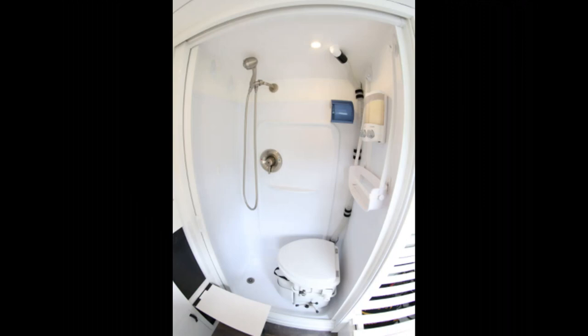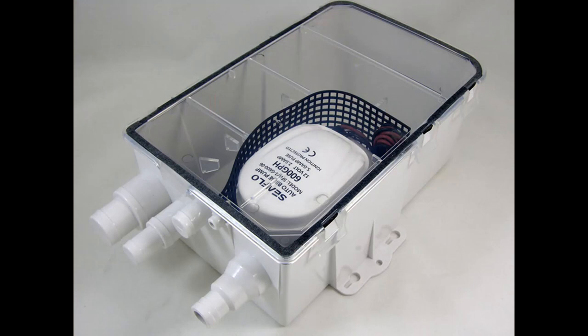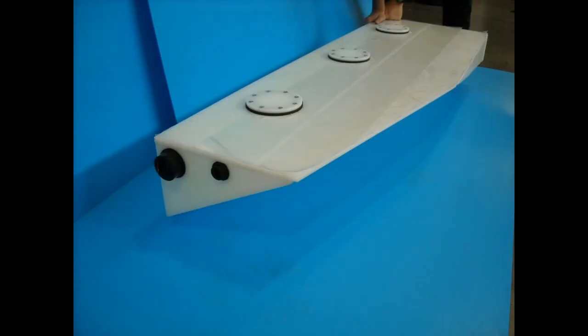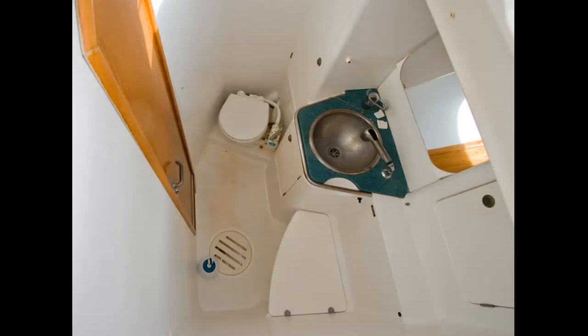The most common shower setup within an enclosed head is the wet type — simply a sealed room, usually with fiberglass, though lots of other waterproof materials are used. Under the floor there's a special box that the water flows into, with a pump that takes the water either overboard, into a large gray water tank, or into a water recycling system. For the shower head, most commonly the spigot of the sink faucet comes off and attaches higher up the wall. I'll be talking more about the plumbing and gray water recycling system in a future video.